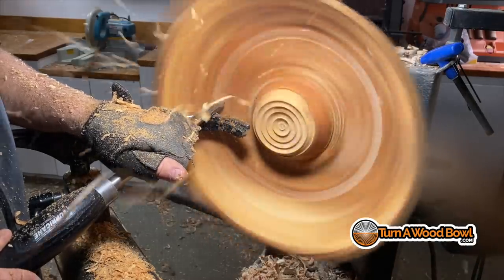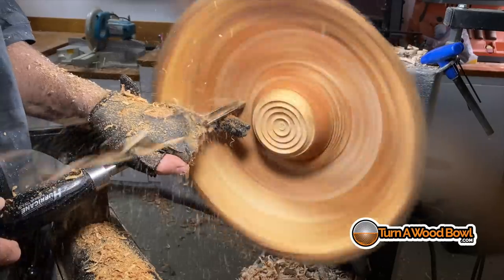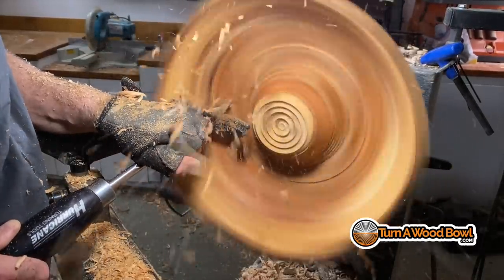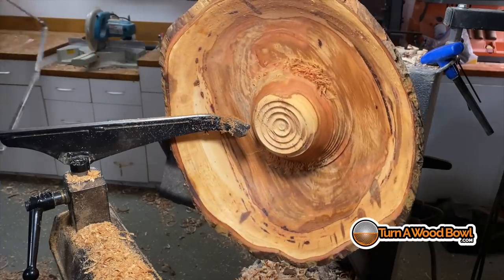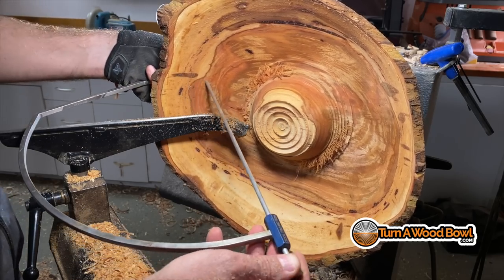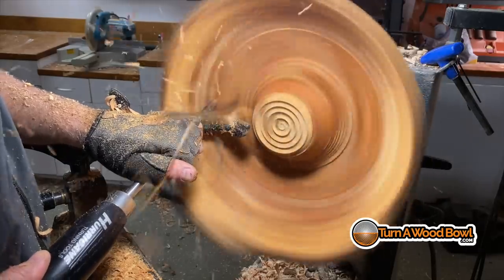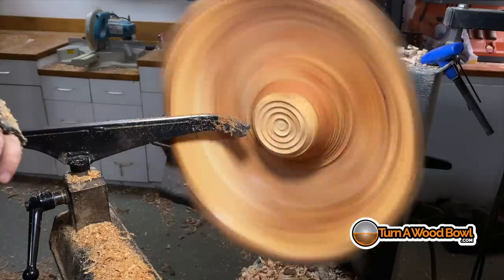I mentioned in the first video that because of the size of this bowl blank, the cutting edge is being used a lot — we're talking miles and miles of rubbing on that sharpening edge. So in this particular turning I'm sharpening the bowl gouges about every 10 minutes. Several times I've gone back to the sharpening station and the CBN wheels are still spinning from when I turned them off the last time because it was only a few minutes and they were already dull. Okay, I'm going to use my depth gauge here — it's like a plunge stick that leaves a gap at the top. I'll put a link to that depth gauge in the description below.